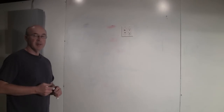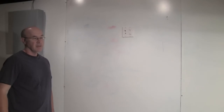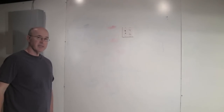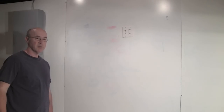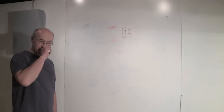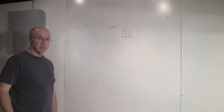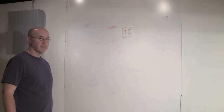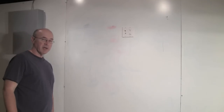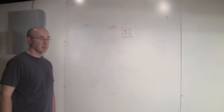So let's talk a little bit about what happened in my house, what I observed. So basically I turned on the air conditioning thermostat, said everything was fine. But there was no cold air coming out of the vent. In fact, no air, not even warm air. So the first thing I did was go outside and I observed the compressor was actually on and looked normal. Next thing I did is went to my furnace and I observed that the fan wasn't on, so I figured that was a problem right away.